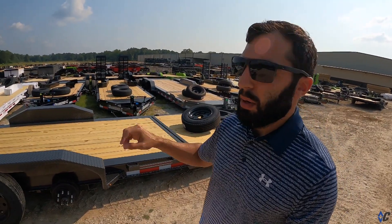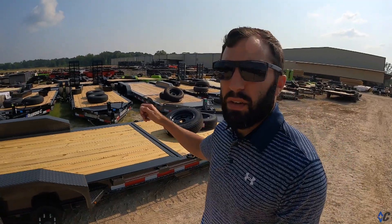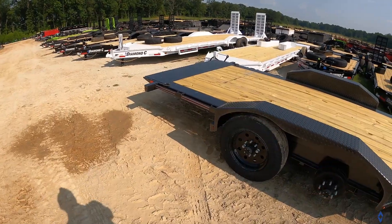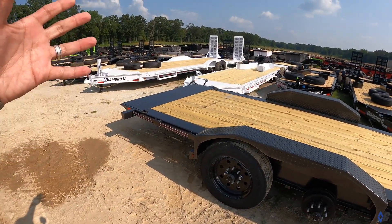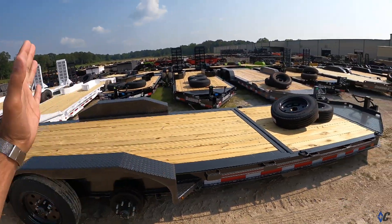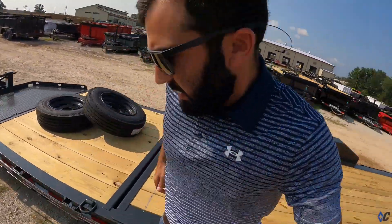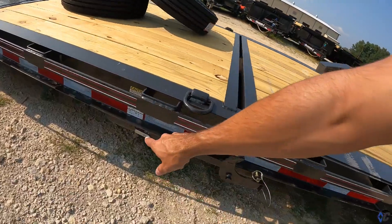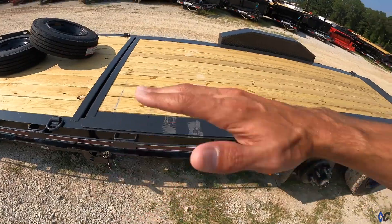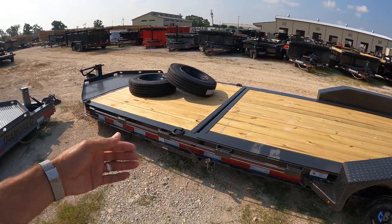It's a gravity tilt, though you can also get a power tilt to force it up and down. In gravity tilt mode, you unlock the bed, step on the back, and the tail goes real smooth down to the ground — whether it's just you on it or if there's more weight. When you drive your machine up, the bed slowly starts coming back down. There is a speed control valve on the side to help slow that down if needed — just crack the valve. That handle right there is for unlocking the bed so it'll tilt.